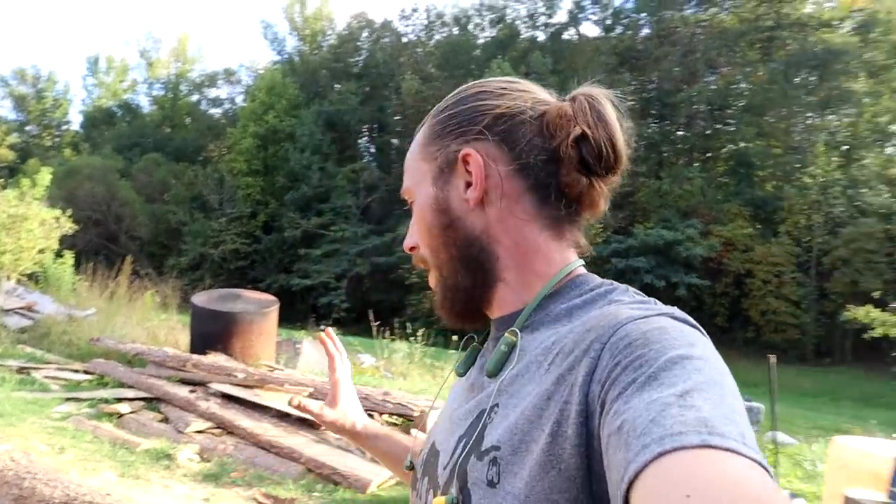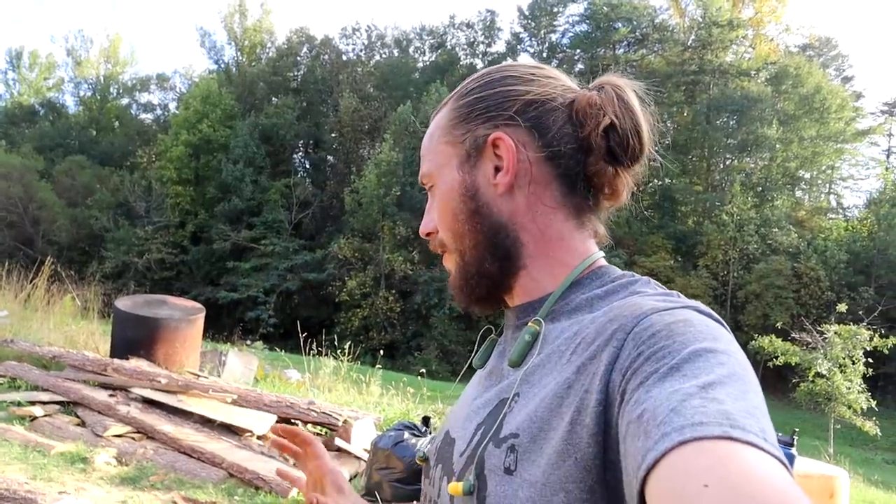So now that I have two clean faces, I can lay out my boards. This thing's so heavy I don't have to worry about it moving. I like to use a level. I'll try to get the camera in to where you can see what's going on. Basically I just measure out the curve of the blade plus however thick I want my boards. I try to get my boards between an inch and a half and two inches — pretty meaty. I've found that if I just draw a line every two inches, then you take out about three-eighths to half an inch for the kerf of the chain. They'll come out around an inch and a half, plus or minus if I get a little crooked. So let me get these laid out and then I'll start cutting.